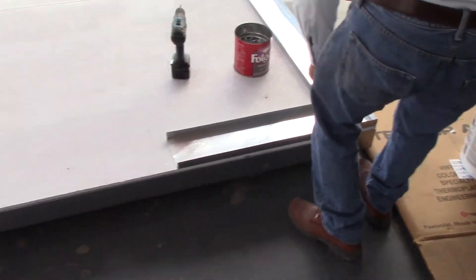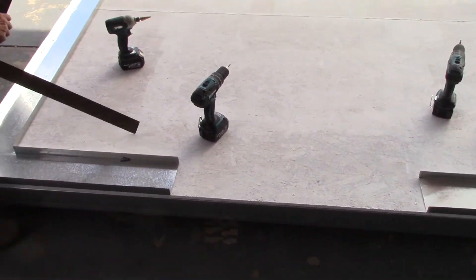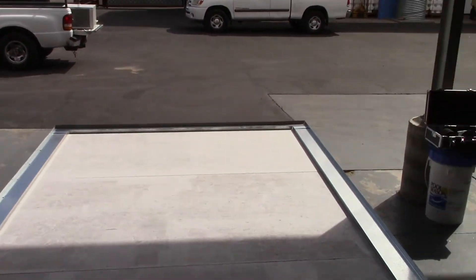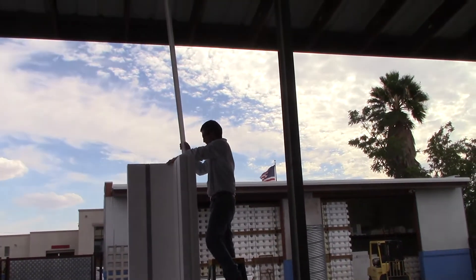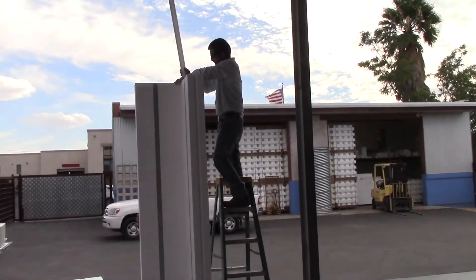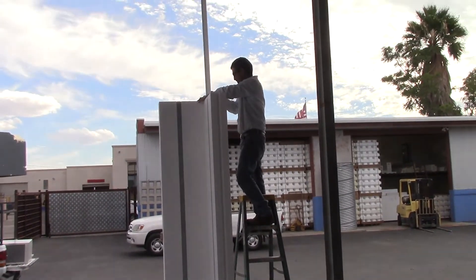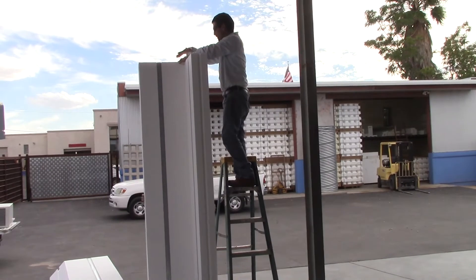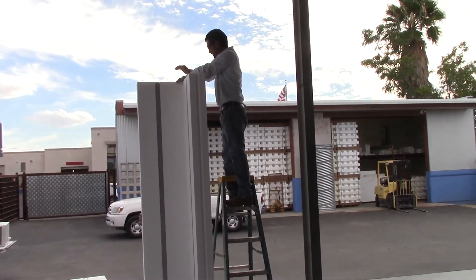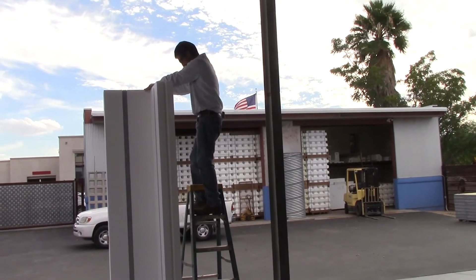Hector's got the first go around the track pretty much put on. We've left a rough opening here for a 2-8 door, 34 inches — everything else was complete. We can stack walls here in just a minute. Here's Hector and John just setting this first corner up, and once they get a corner up they can just run with it. He's dropping that bowtie down — that'll lock the panels together.